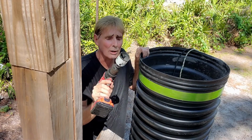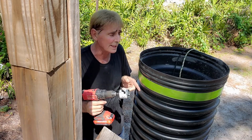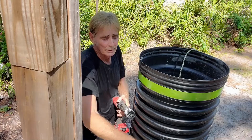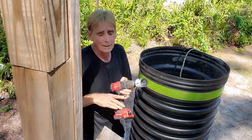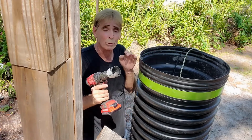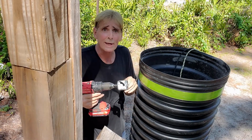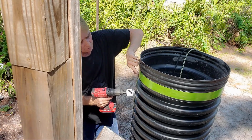Okay, 2-inch hole saw. Make sure that you've got a deep one if you're going to use a culvert pipe, because these ridges are pretty deep. So we want to make sure we can cut clear through, make sure that it's clean, you have no debris or other uses inside of your drill. And notice that as installers, we have always carried 2 drills, but this one always has the 5/16 inch bit, and this one is for the hole saws. Remember, we're also going to cut an inlet line for the footer pipe or the French drain, and it's going to come in quite deep in the bottom, but we won't cut that today because we don't know that exact depth yet. But anyways, right here, remember that we want to be below grade.